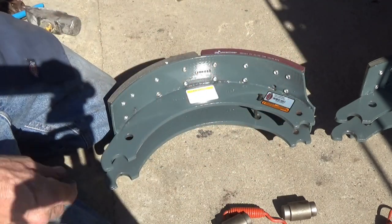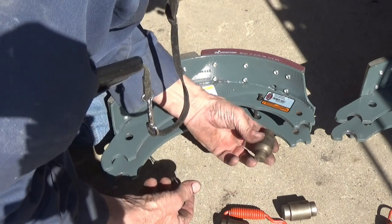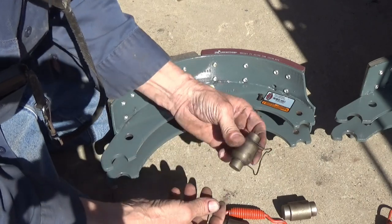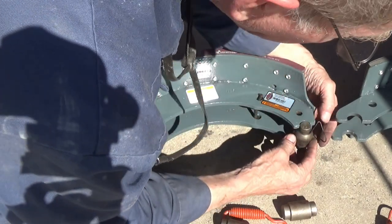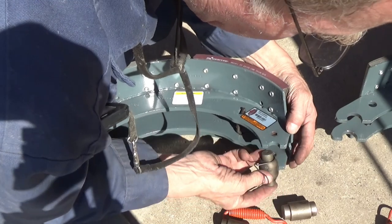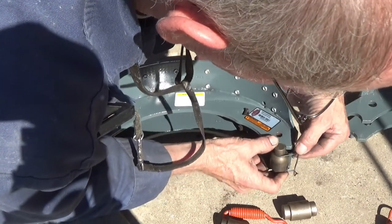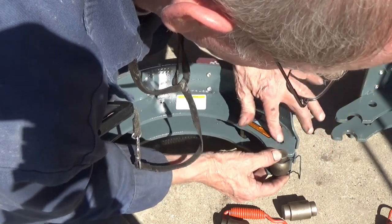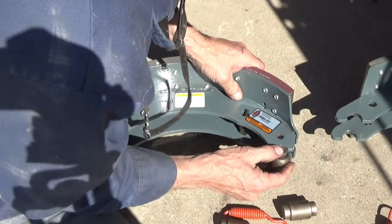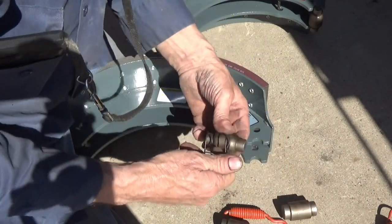That's what this spring is going to hang on. There's a little detent right here and this spring will hang — you don't want it off on the edge. It'll probably go on the edge when you assemble it; that's okay, you stick a screwdriver in there and push it over. Hook these rollers on there like that. You want to push these in so you can pull the loops out — not this way, not that way, but this way. These little ears right here are going to be in that hole. Squeeze that with the fingers, and that one's ready to go on.